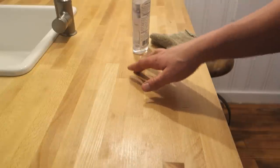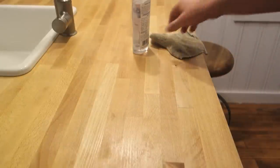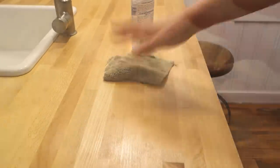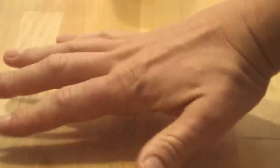You can tell when you're ready to stop adding coats because the film you see on the surface will have soaked all the way down. When it no longer soaks in, you know you've penetrated deep enough and the countertop is sealed. When you first get your countertops you'll notice it soaks in really well, and you'll be tempted to apply another coat right away — but don't. You're wasting the mineral oil, since there's still a thin film that takes roughly 24 hours to fully saturate.